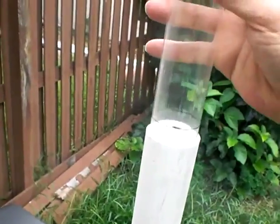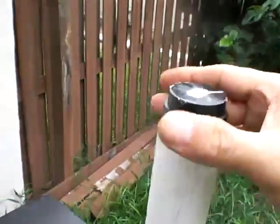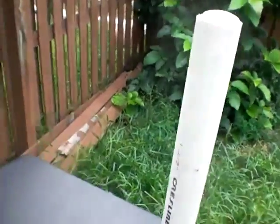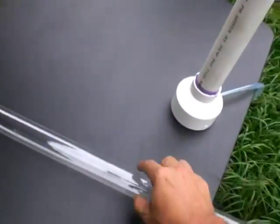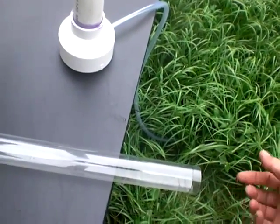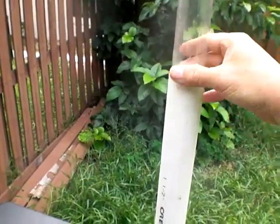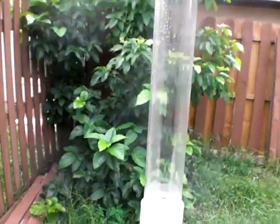If you fill it up to the top, the very first time you put this in, it's going to overflow. So when you go to add water, you might want to be outside — at least that way it'll tell you how much water you need. The only purpose of the water is a seal: when air comes up to the center pipe and pushes on the inside of this tube, the air can't go out that end, so the only place it can go is pushing against the water. What ends up happening is the tube gets pushed up instead — the gas is pushing at the top and pushing against the water at the same time, and the more gas you put in, the further this extends.